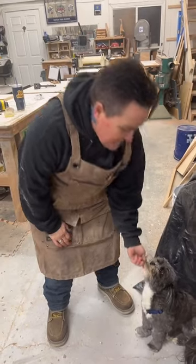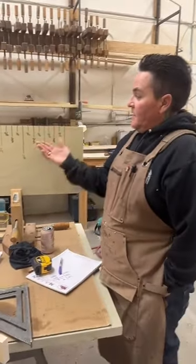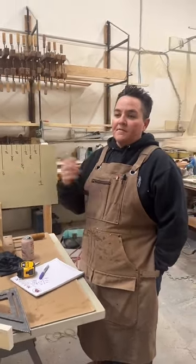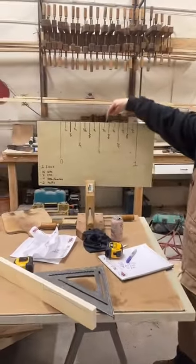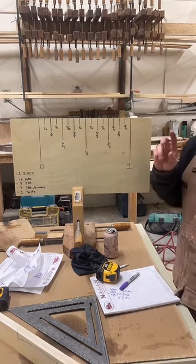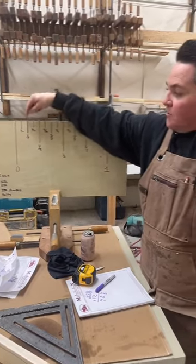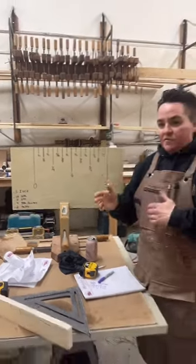Okay, can you explain how to read a tape measure one more time? Sure. How to read a tape measure: each inch is the same, no matter if it's 12 and 5/8 or 150 and 3/16. Each inch is broken up into 16 equal pieces, just like a pie. The smallest marks on your tape measure are called 16ths. Even though this one that says 1/8 is 2/16ths, it's called an 8th because it needs to be reduced.